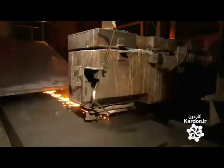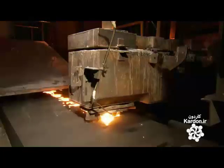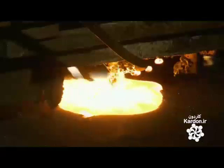The molten iron arrives and flows into a channel leading to the molds. As the liquid metal cools, it solidifies into the shape of the mold. A vibrating conveyor shakes and breaks the sand molds to reveal the cast iron stove parts.